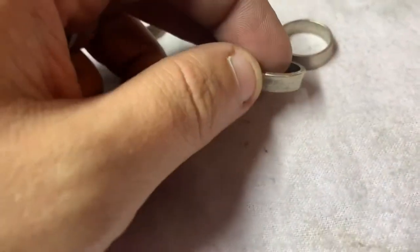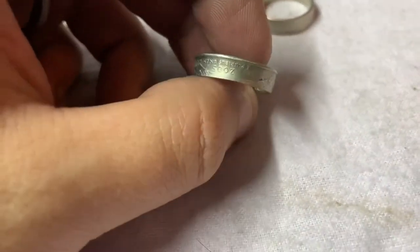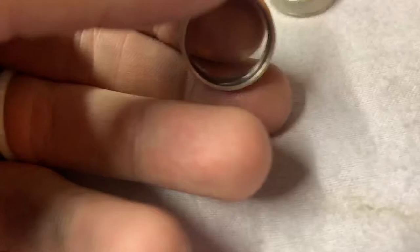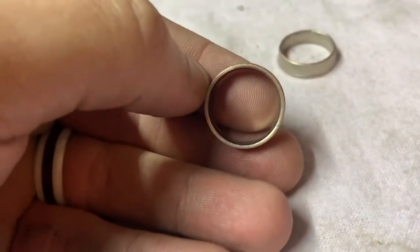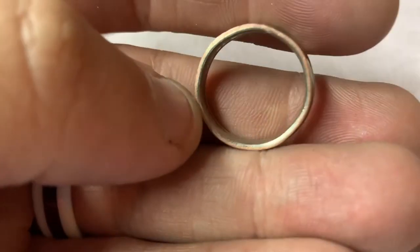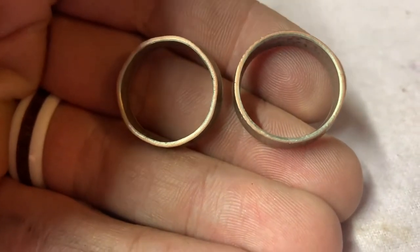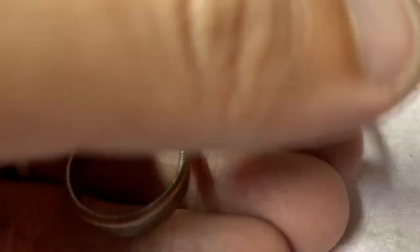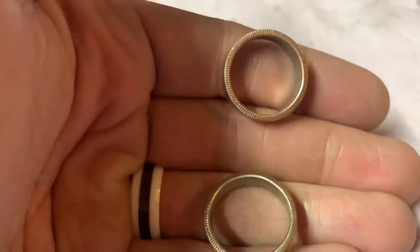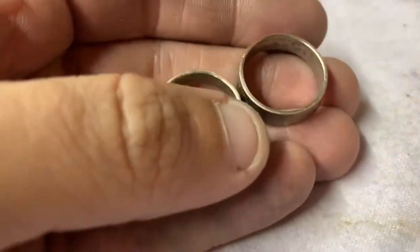These are the most effective ways I've found to stretch and shape coin rings. This one was done on the mandrel and you can see it's still got a nice round shape. This one was done on the Rathburn ring stretcher and you can see it's got kind of some points — you can compare them side by side. But using the mandrel, the ring can get stuck on there, which can be kind of annoying. It does seem to stretch more evenly though.